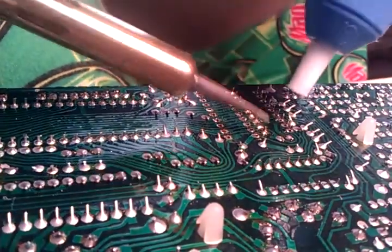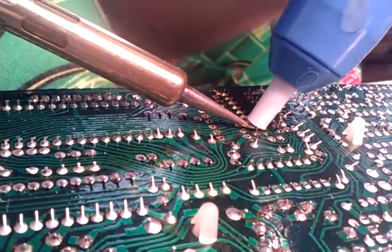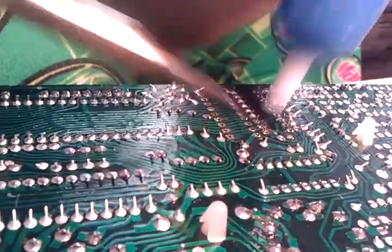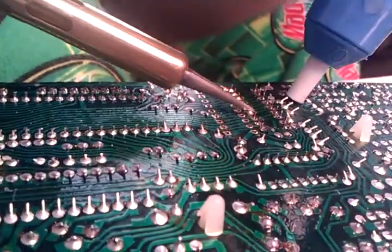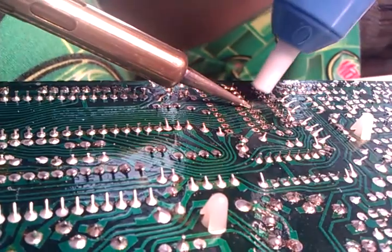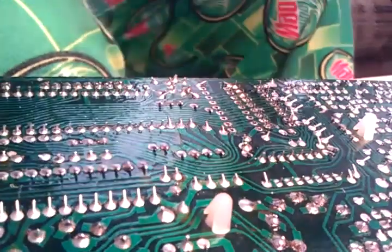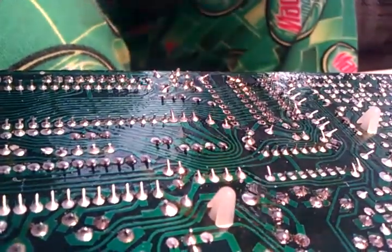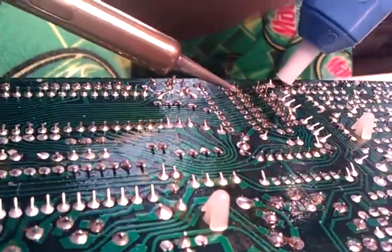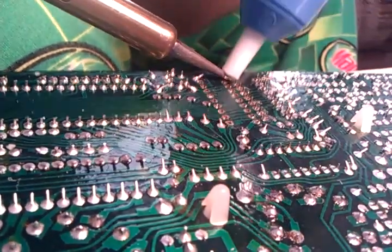As you can see, I'm halfway done. If you're looking at this video because you're having a hard time doing it, I bet this makes it look easy. And with a little practice, it actually is. If you get one of these solder pumps and a decent soldering iron, a good way to practice is to just get some scrap electronics, like an old hi-fi that isn't worth anything, and just start picking parts out. There's actually an objective in doing that, because then you get a lot of cool parts — you might get a transformer, a few good caps, and a collection of resistors, if you don't want to spend two cents and buy a thousand of them at a store.